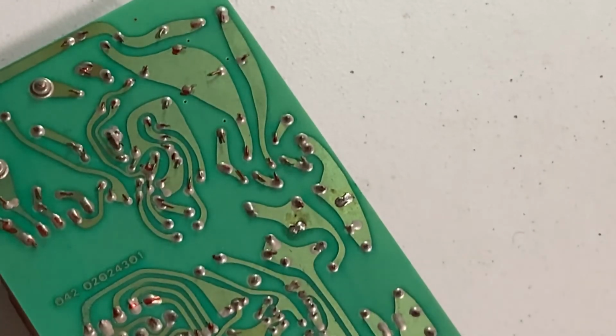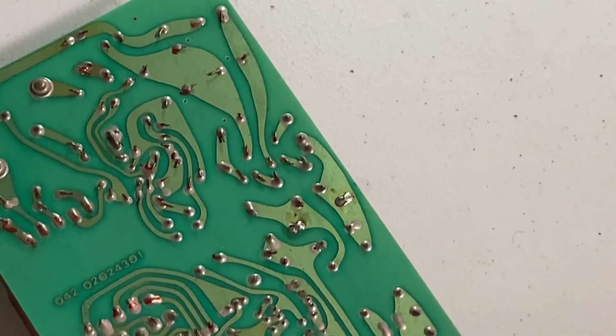Might as well throw in a quick soldering safety tip. Make sure that when you're soldering, regardless of what kind of solder you're using, but especially if you're using leaded solder, make sure you've got good ventilation. I always set up a fan just off to the side of where I'm soldering to pull the fumes away from me. I didn't have it set up as well as I usually do when I'm filming this, so I will move it over a little closer for the next couple.